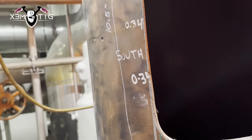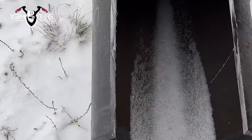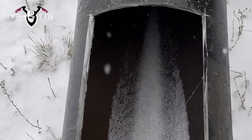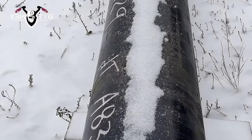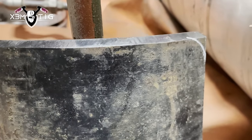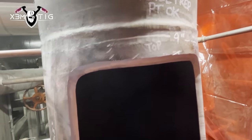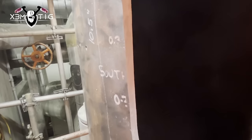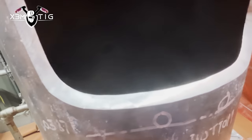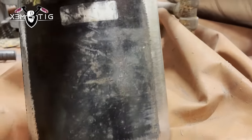As you can see here, looking inside straight from that one-inch pipe — that's where the steam was hammering and thinning the wall. So we're gonna cut another patch, just measure it out, take your measures, and cut it from the 12-inch pipe outside. We're gonna round the corners so it can match that hole on the pipe. Once the bevel is done they're gonna PT — the PT being okay means no indication of porosity, cracks, or anything inside the wall of the material, so it's good for tacking.